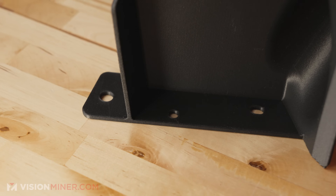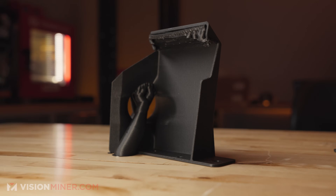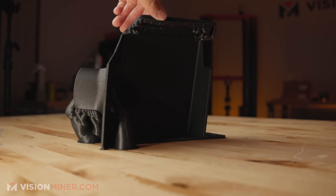I printed this particular part with no supports for these overhangs and it did pretty well. One side of the part had all these crazy supports and the other side without them. This was very easy to print, completely unattended — just showed up the next day and it was done because I trusted the machine and the material. Nylon 12 is more expensive and nylon 6 kind of outperforms it in a lot of ways. Nylon 6 is 190°C, nylon 12 is more like 175°C.